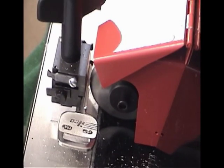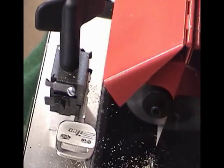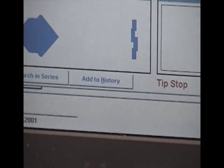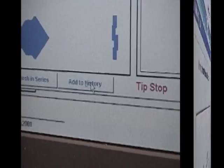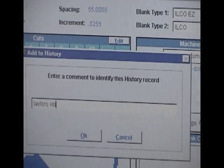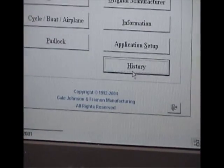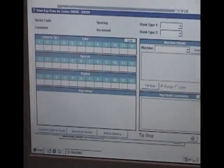Click the Cut the Key button and the machine will begin cutting the key. A window will appear indicating what the machine is doing. Once the first side has been cut, flip the key over and cut the second side as directed by the program. If you are interested, you can add this key to the history database by clicking on the Add to History button. This will allow you to enter information to identify this key for future use. After the data is saved, it will be stored for future retrieval under the History button at the main menu. To recall a previously saved key, click on the History button and select the record. You will be returned to the key cutting screen where you can make another key for the customer.